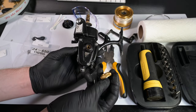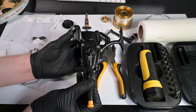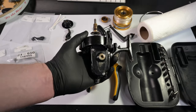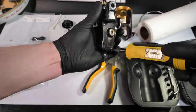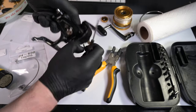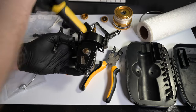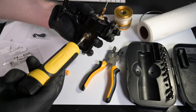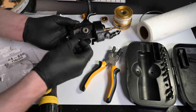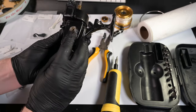All right, looking at the open bearing cover, we just screw that right on off. And then we got a little seal washer there, which is kind of a funny fabric, greasy O-ring thing that's wildly obsolete. Then we're gonna back out the housing cover screws. That's gonna eventually free up the housing plate. There's the closed bearing cover, so that just unscrews off on the other side of the housing. And then this bad boy is a standard drive screw, and we just screw that right on out. Now our housing plate should just pop right on off.